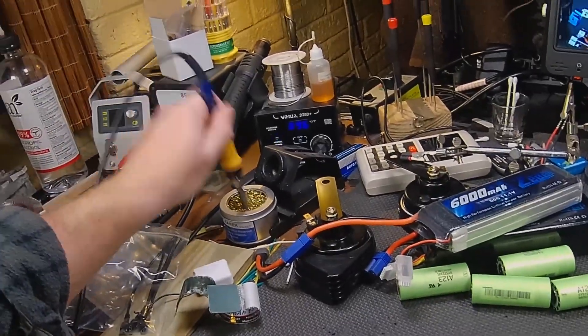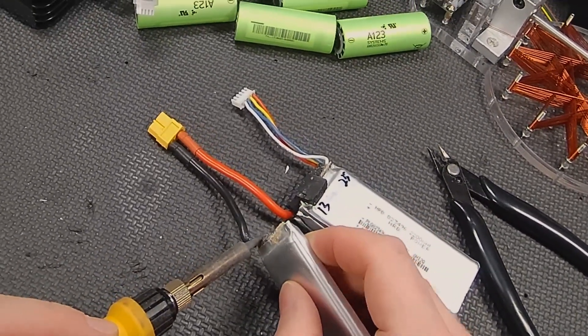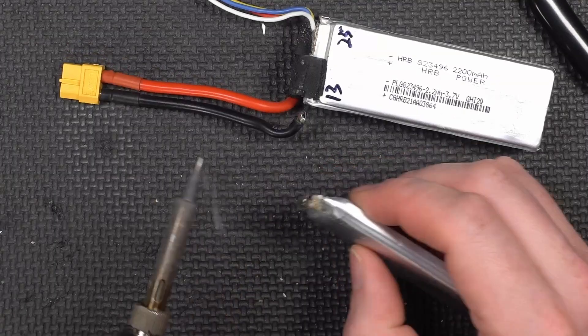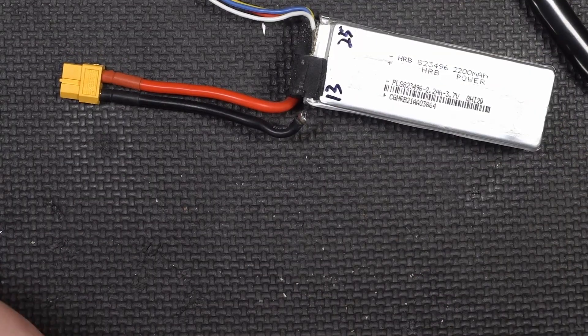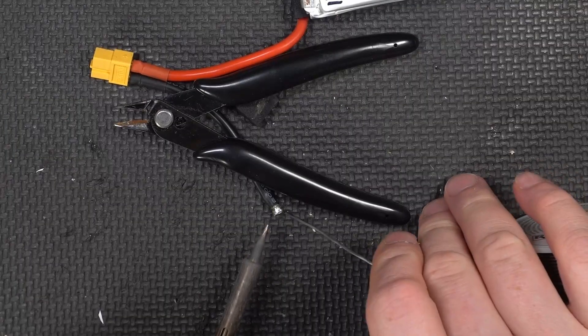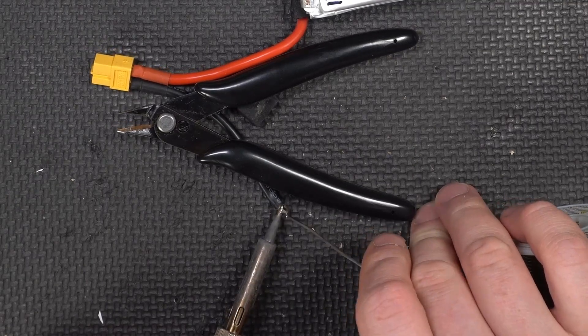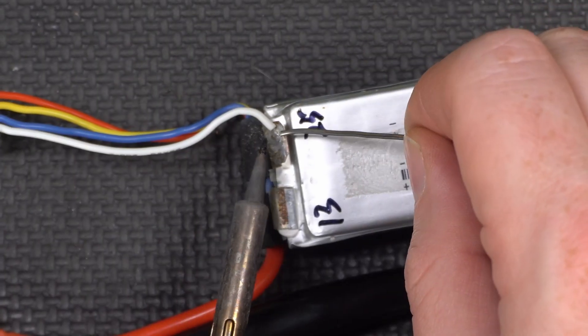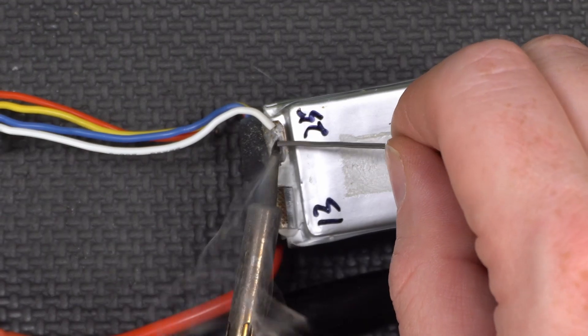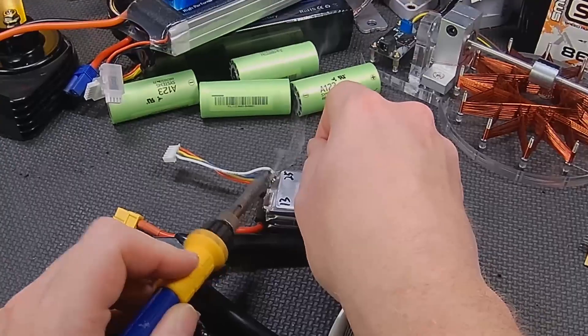The best thing to do here is to desolder the heavy cable from the dead cell. That pops right off, of course. Then I'm just going to add my own solder to it. It always helps to flow the solder, especially if you have solder that may or may not be lead-free, and particularly on cells like this — the solder that's on there is kind of grungy looking. So I just float a little bit of solder.